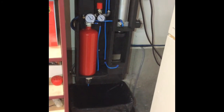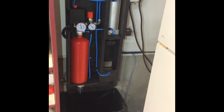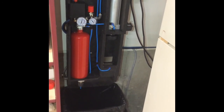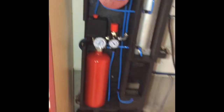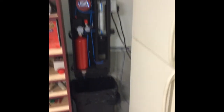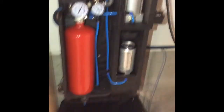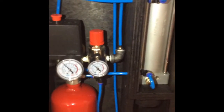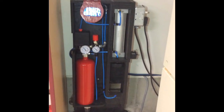The blue line off the bottom off the air collector — the air compressor just kicked on. It'll toggle things up and turn off around 120 PSI. All that is is a water collector, and I had to actually remove the spring from it because it wouldn't seal the air. If it'll do a big one it'll do a little one. The nice thing is all we need is about 50 PSI — that's about the maximum required for the size of cylinder to adequately crush the can.